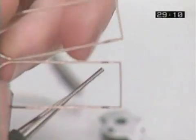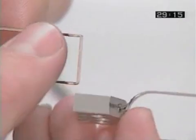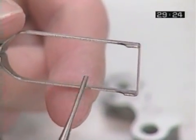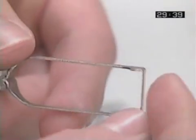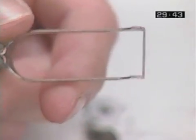Out of the bag, it'll still have a sharp edge that runs up the entire circumference of it. So what you need to do is take a small file and a polishing stick and just lightly break this edge in here, run it up so far, so whenever the bow is inside the mag well, when you put a mag in it, if it does move around in there somehow or another, it'll kick up past it. It won't hang up on it.